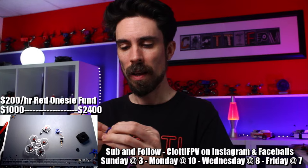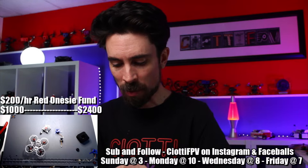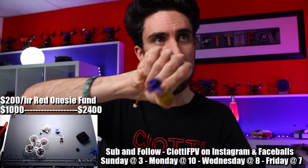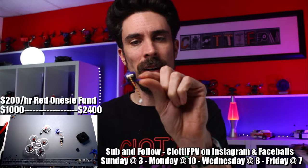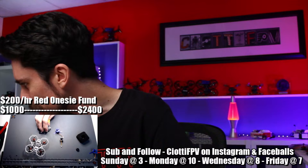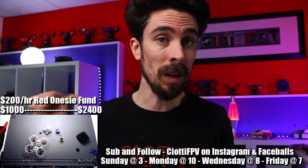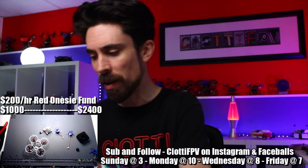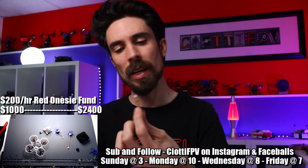The McStinky mount, for anybody that's not familiar with it, is available over on Thingiverse, and it's just a very simple, really solid camera mount that a lot of racers run. I think it might have been designed by T-Dog, one of the top racers, or maybe he just runs it. But yeah, super simple little mount. Nothing crazy. One of the issues that we're going to run into, though, is the UFL plug on the Happy Model AIO is up front, and so any of these three post mounts here, the front of the mount kicks up a little bit. It just gives a little bit more up tilt, which I don't love, but it's not the end of the world.